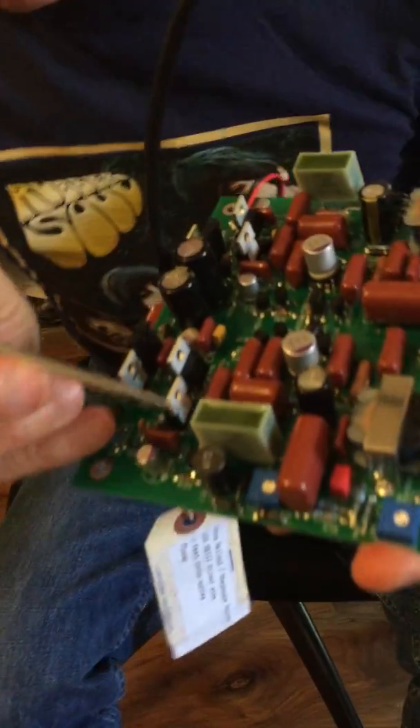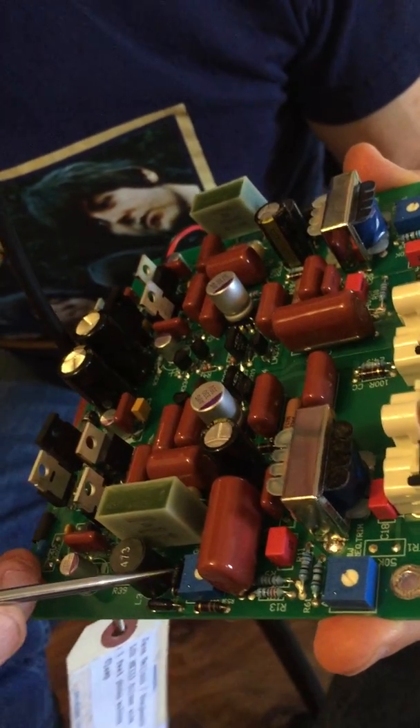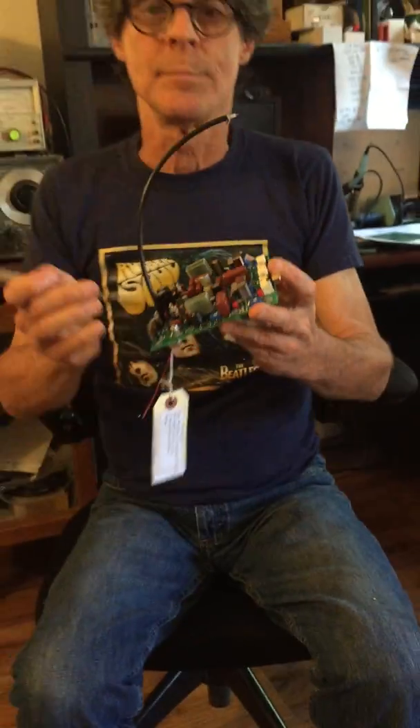On the top of the board there isn't too much to see, but we'll go over the two items that are different. If you can zoom in closer, these resistors right here — this one and this one — and there's also a set like this on the other side of the board. This is for the high frequency network, and those are precision thin film resistors — actually 0.1% resistors. That is a very nice thing because they balance out the signal in the high frequency inductor and are also very good at high frequency translation of sonics.